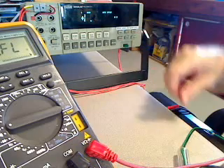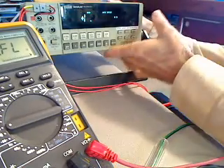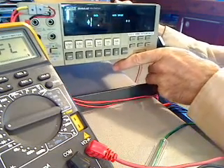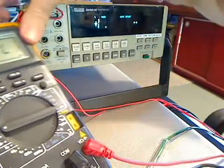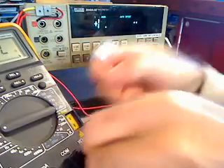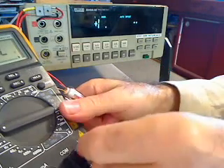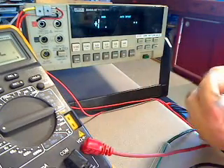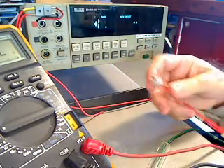The lab meter also has an offset button to zero the leads. I add my own little connector that connects to the positive and negative terminals inside — because I hate these banana plugs. They're notorious for oxidizing, and you've really got to wiggle them around to make sure you've got a good connection. Since we're talking about very little current when measuring resistance, we don't need giant contacts.